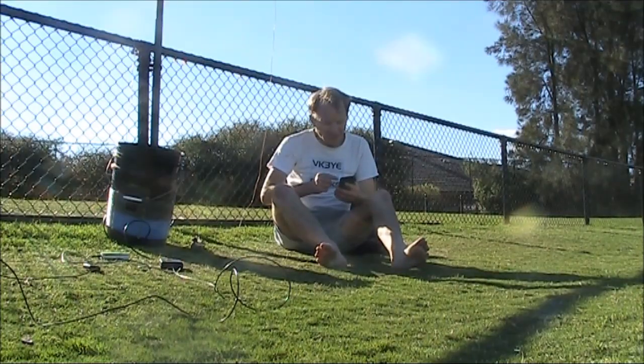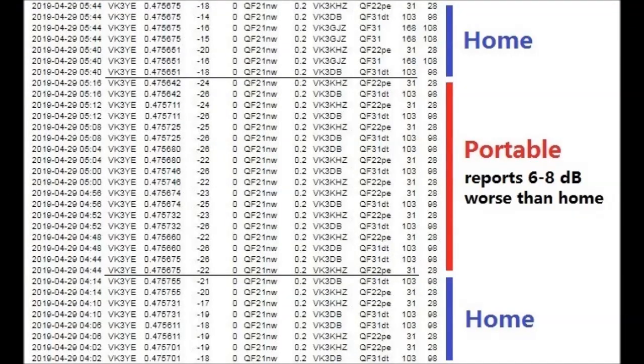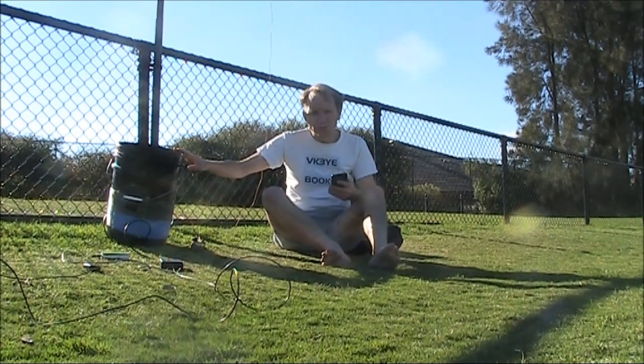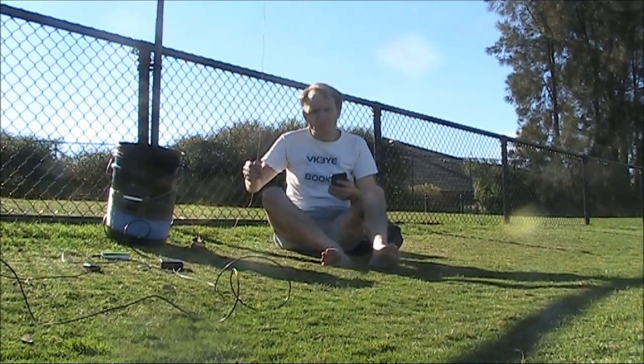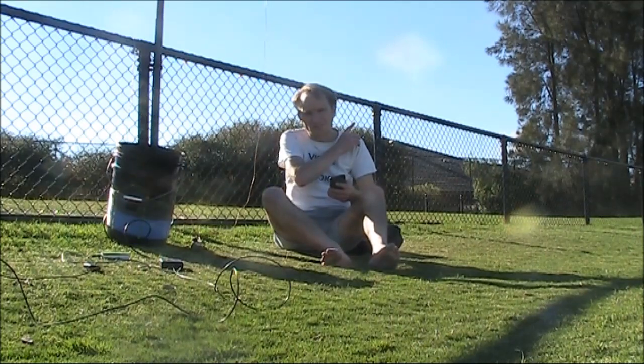Having a look, I'm getting some reports from VK3KHZ and VK3DB that I got previously. I probably don't have enough loading for the antenna length used. I could fix that by having more turns on the coil, or even better, having a longer wire antenna.